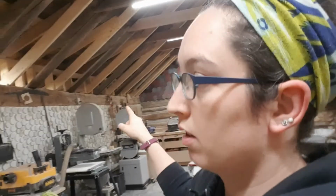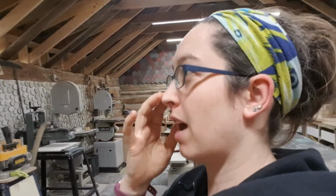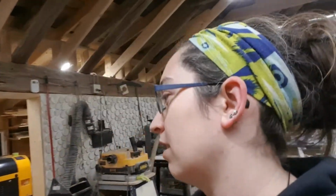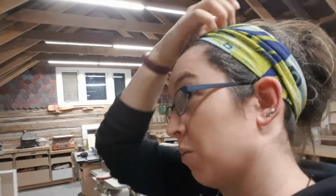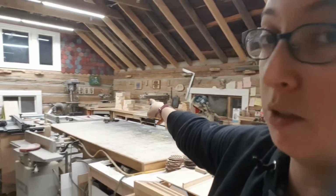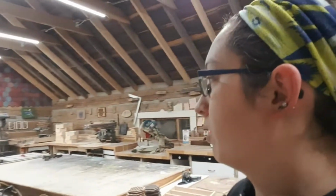I have 12/2, which is a heavier gauge wire than regular. I have it in order to run a plug on a switch all the way over there. I'd prefer that it was armored cable, because when we first got here, the mice had chewed every single wire in this place. Now all that was behind walls, and most of my stuff is not actually behind walls, it's just strategically run where you can't really see it that clearly from here, but eventually some of these things will get closed up into cavities. Like a lot of the electrical for all these walls is actually being run behind that backsplash all the way around, which is what that's for, to mount the plugs into.